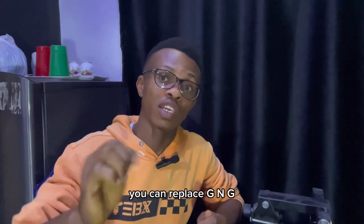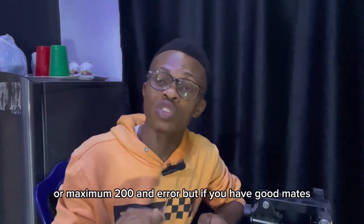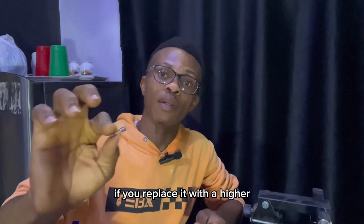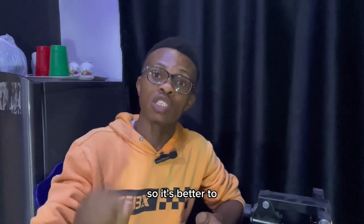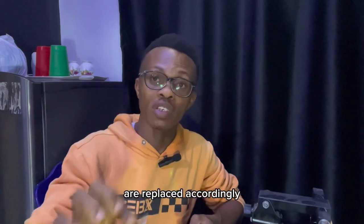If you're in Nigeria, you can replace it with 100 naira, 200 naira, or maximum 300 naira. But if you replace it with a higher rating and your equipment gets spoiled, you won't use 100 naira or 200 naira to fix it. So it's better to always pay attention to the rating on your fuse and replace accordingly.